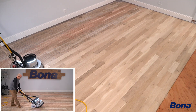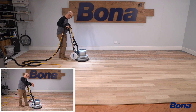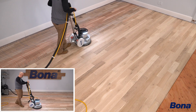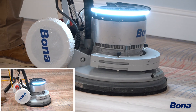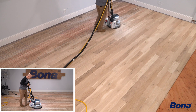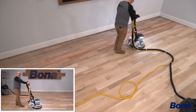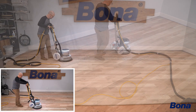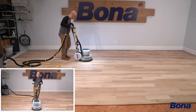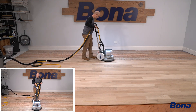The last position I'll call the lawnmower. With it in this position, my heavy cut is all the way in the back and I'm feathering in the front. I move from the wall all the way down, then move back in the same path. Going one way, I'm cutting heavier because I'm pushing against the machine and the cutting is in the back. Coming back, the feathering side is in the front so I'm feathering the whole way. If you use the lawnmower method, we'd recommend moving back to the perpendicular method for subsequent cuts to ensure good cutting and feathering across the floor.